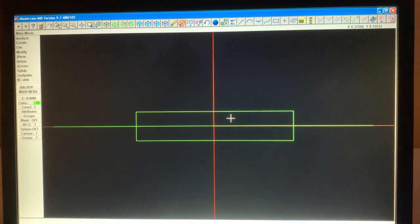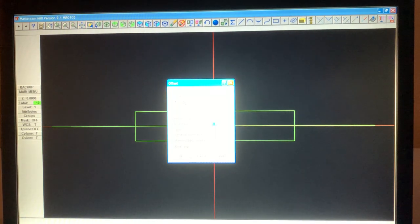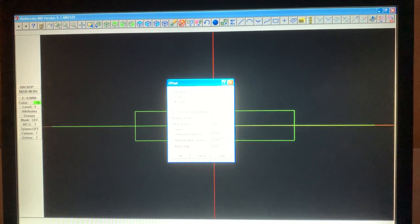So now we need to have the center here, and that center has to be 1 inch. Well, we could work from the ends here and here. So from here to here, it has to be 691. I'm looking at the blueprint on my little screen here. So we're going to do the same thing, modify, X-form, sorry, offset, and we're going to copy, and we're going to move that 0.691.